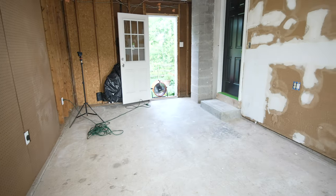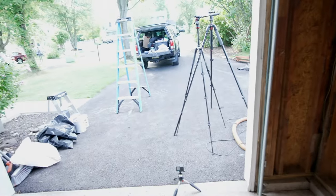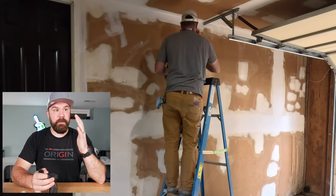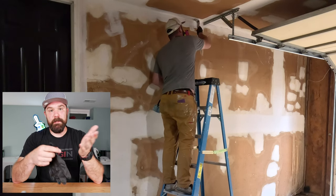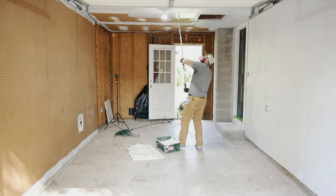The other big thing along with a good respirator is airflow. When I did the garage, I opened up the back door and the main garage door, and I had a fan — my big air mover — blowing air through. Another thing to consider is gloves. The reason I use them is if I'm cutting in a ceiling with the shellac, it's a very runny product so it's going to drip and come right down your brush onto your hands, and shellac is somewhat difficult to get off. So having gloves on works really well — just protects your hands. And if you are rolling overhead, definitely wear a hat because that'll keep some of the flecking from coming into your eyeballs.